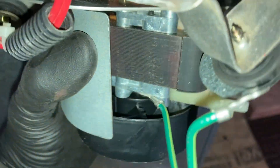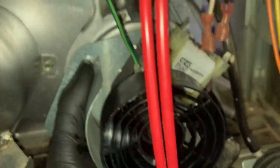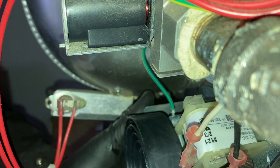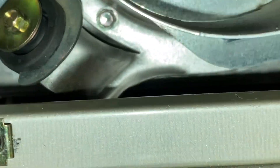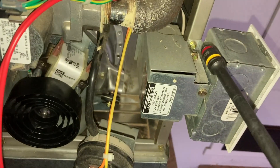This mounts upwards. Got to make sure the wheel goes into the housing. Line up this hole with the hole in the back there. The only thing left to do after you've tightened these three screws right here is to plug the motor in. If you removed this panel to get access to the motor, just retighten that right here.